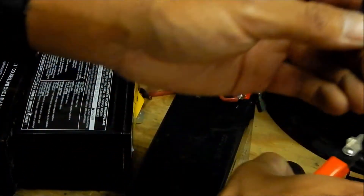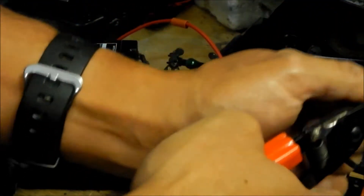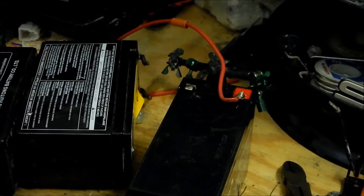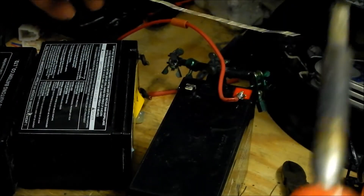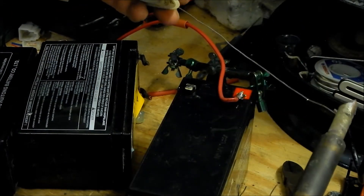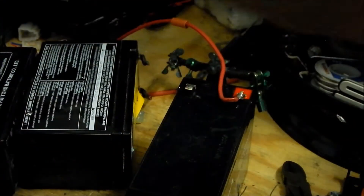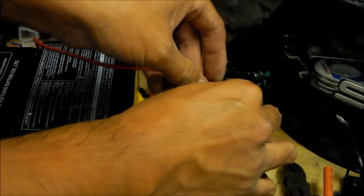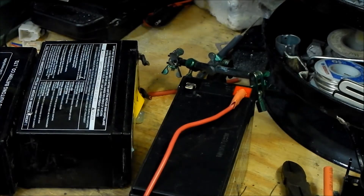While you're doing that, you can start prepping this other one. Go ahead and strip this one out. My suggestion — I will make a suggestion at the beginning of the video — go ahead and tin that since it's kind of just dangling in the air. Tin it like that. Go ahead and put the jacket on, then use the heat gun.